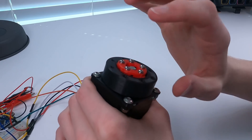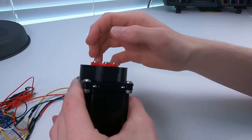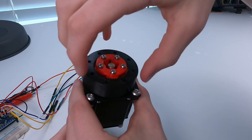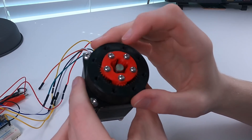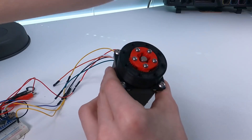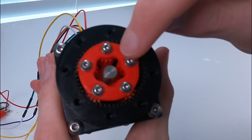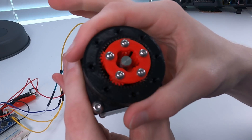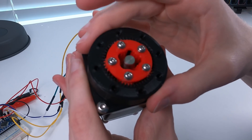The main operating principle is that the top ring gear has one fewer tooth than the bottom — in my case, 50 and then 49. The result is that when a planet makes one full rotation, it offsets the top and bottom ring gears by that one tooth, giving a 49-to-1 reduction already, with additional reduction compounded from the bottom being a normal planetary gear set. You can see the bottom sun gear moving very fast, the carrier moving slower, and the output ring moving really slow. Because of those lowered clearances, this mechanism is also a lot quieter than the previous one.